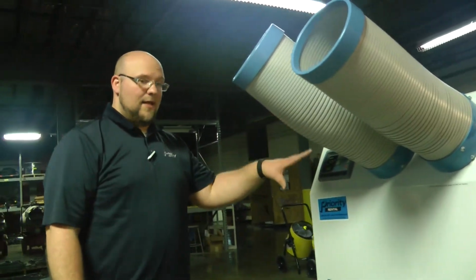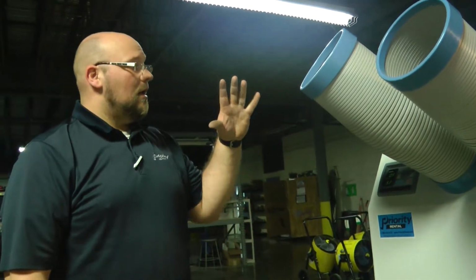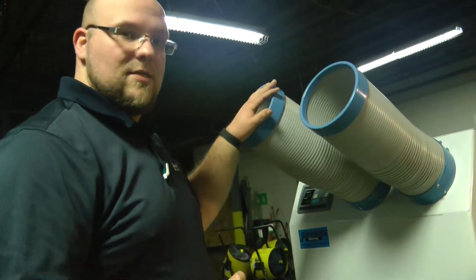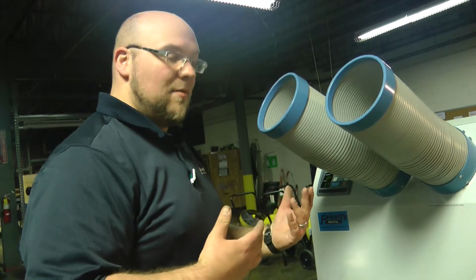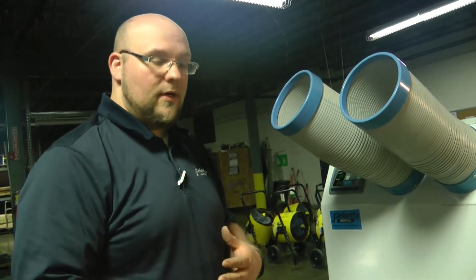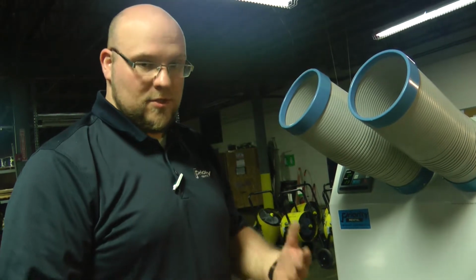And again, even in that condition, it'll still protect itself and go through a 60-second countdown. As you can hear, you'll still hear the blower motors run. That's standard. If that runs too long in that condition and you're in a loud atmosphere, you may not hear the compressor making that sound. And therefore it should go off on an E4 message, if it hasn't already caused damage to the unit, which is what we don't want.